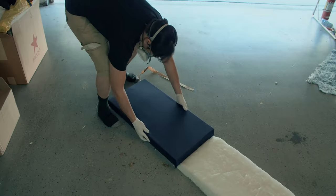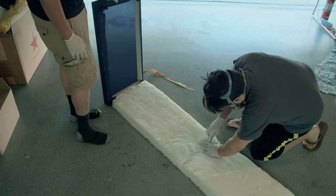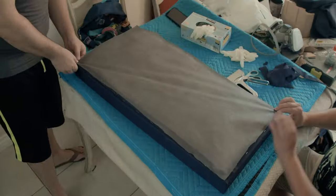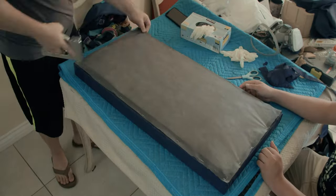Next came the insulation. We made our standard panels to fit the length, width, and height of a strip of insulation, so nothing too fancy in terms of techniques, but we do have tips. You want to remove the moisture barrier from the insulation to keep the air and sound particles moving. Use a sharp blade to get even cuts. Be sure that the insulation fits snugly and that you don't compress it — its structural integrity is vital to getting the best performance. Once done, line the back of the panel with an equally breathable cloth to keep the insulation particles in and keep the sound coming out. We used utility backing fabric from our local fabric store — just cut and staple.